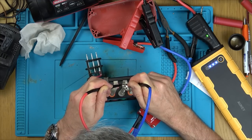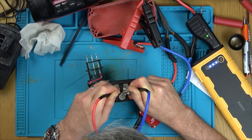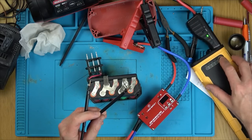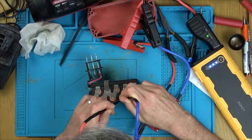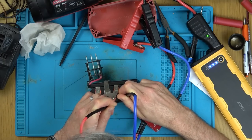One thing I'm doing different here than before is last time I always kept one lead in the same place, but a lot of people correctly suggested that that will put too much heat into that one spot and you could blow through. You need to move both probes. Every time you do it, you need to move to a new location. Otherwise, you're just going to keep putting the weld into the same spot over and over again.